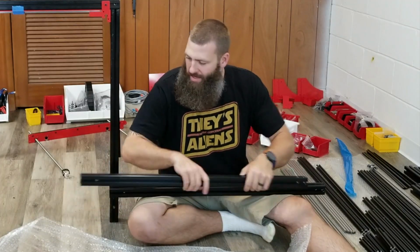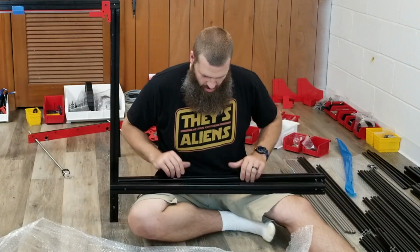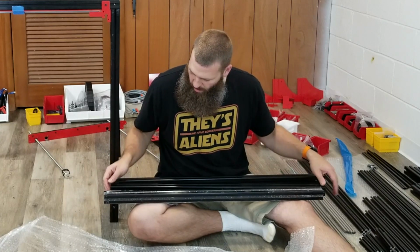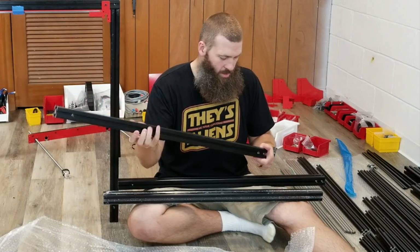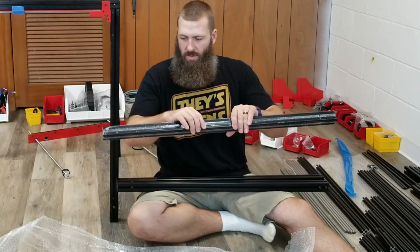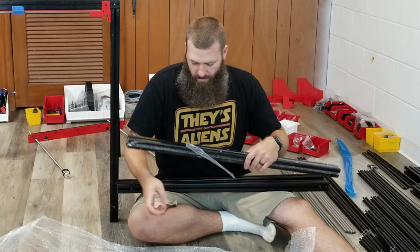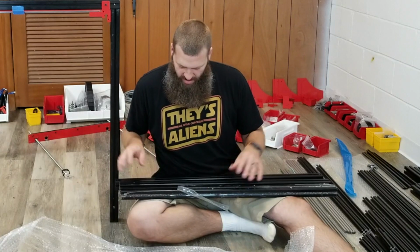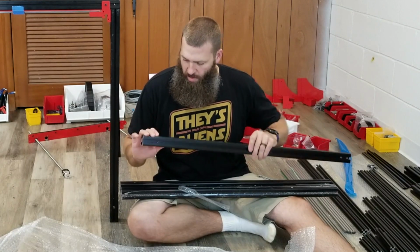So here's another interesting point. In the extrusions that I got directly from Modix 3D, 2 of them already have the protective plastic removed from the extrusions themselves. So no chips, nothing like that. Just the actual 40/40 profiles here. The third, however, still has the plastic on there that I've talked about before. So it'll be interesting, I guess, to compare how the 2 look next to each other. The kind with the protective plastic and all the aluminum chips in it, and the kind that doesn't have the protective plastic and therefore doesn't come with nearly as many chips.